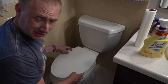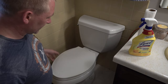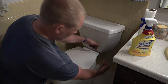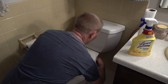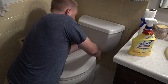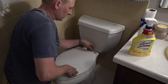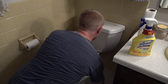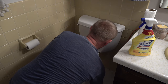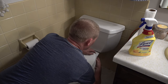We're at the throne of justice. I've spread some Lysol and cleaned the seat off a bit. We're going to remove the seat first — there are two bolts on the toilet that unthread from behind. There are covers that pop up; they're a slotted screwdriver type. They can get stuck from buildup. Once I get it off I'll show you what it looks like. They have really long threads but it's just a plastic screw with a slotted head, and a grip so you don't need a wrench.